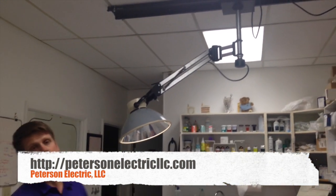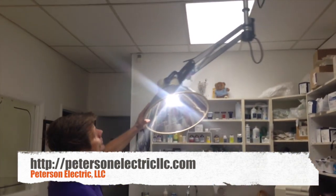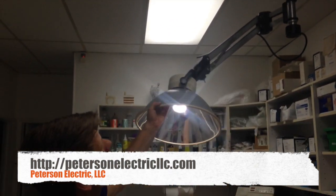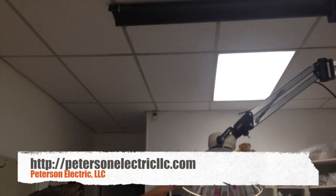These things weigh — my guess is probably close to 80 pounds on this one and the one in there maybe close to 100. But it's a fairly solid metal plate sliding on a track. This has got an LED bulb in there so it's only burning 13 watts. But we did have to lag up through the joist and run some all-thread down in all four corners to get this thing to hold right.